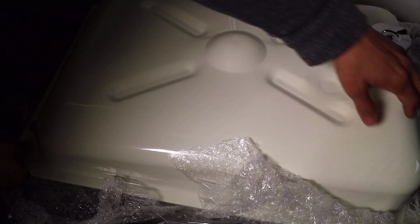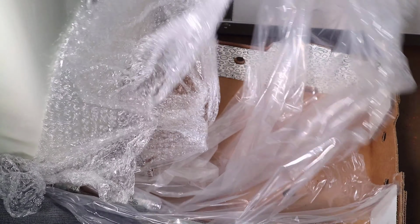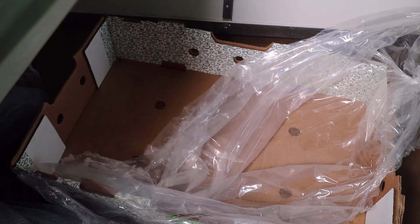To properly prepare the surface before painting, you could go as far as to wet sand the entire surface. Another option for surface preparation is to wipe down the surface with a solvent such as alcohol. This will help to remove any excess dirt and oil. This again wasn't going to be a proper paint job, but rather a quick and inexpensive way to match the color.